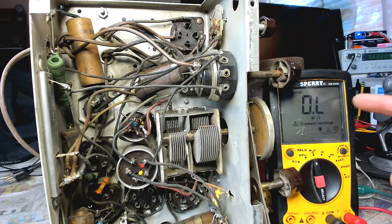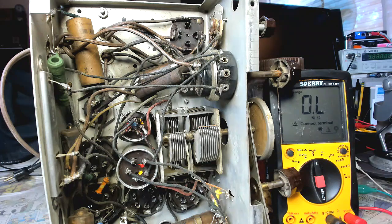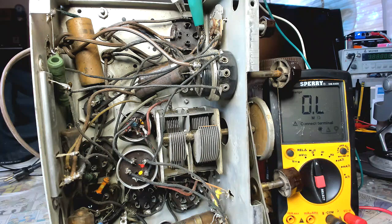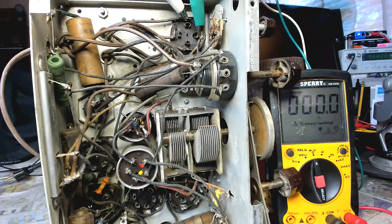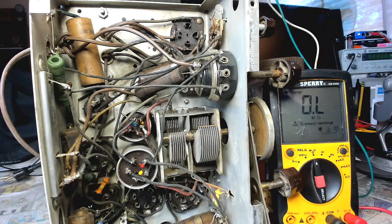Okay, we got our meter here. Here's the 80 socket. Now the first thing I'll check is just the fat pins on the 80 socket. Now those fat pins are for the heaters, so we should see some continuity. Looks like this is fat here. There's fat here. Oops. Come on, Buzz. Here's one. And here's one. We should get a low reading here. That's good. Yay!